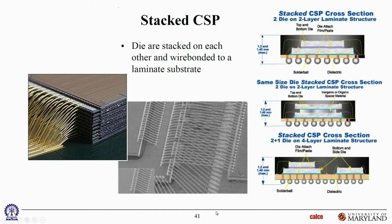And here are some actual examples of wire bonded 3D die stacks. Okay. So you can see here's a larger die, smaller die. The two dies are talking to each other directly through wire bonds. So that's a 3D stack, not a 2.5D. Then this die is talking to another die next to it, not stacked on top of it, but next to it, but directly talking to that die. And then there are some that are going into an interposer down below, and that interposer will go connect somewhere else. Here you can see all of these dies are connected to some interposer. Although they're stacked on top of each other, they're all going down to a single substrate over here.